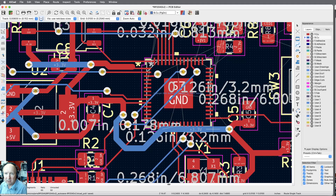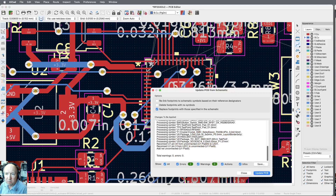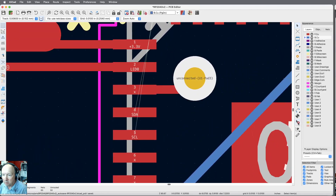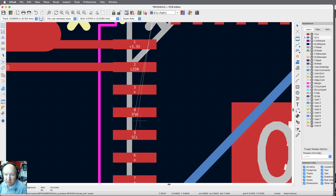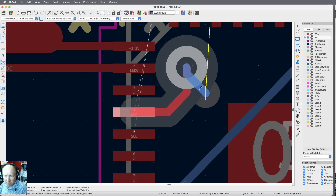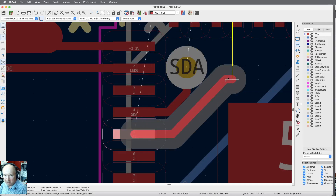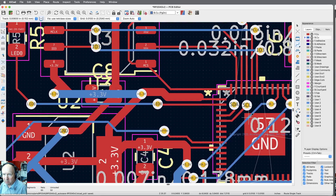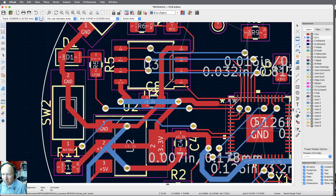Flip back to the PCB, reload, update, close. That makes it a little easier. The old connection is now unconnected, so that goes away. Now I've got the SDA and SCL lines that need to route through. SDA line — I want a via — and the SCL line, can I get that through there? Awesome. It won't let you place a via if there isn't room for one. Now I can run the lines on up on the blue side — not a problem.